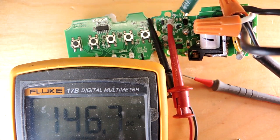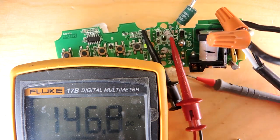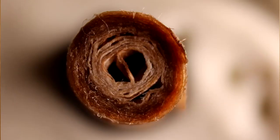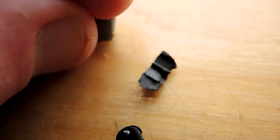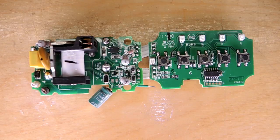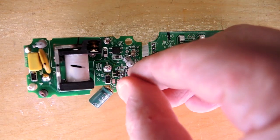It's a 22 kilohm resistor, so it's dropping a huge amount of voltage and dissipating about 0.9 watts. The problem is this resistor was placed right next to the capacitor. The design engineer essentially put a gigantic heat source right next to a capacitor, and that really shortens the life of electrolytics — it basically boiled off the electrolyte. I removed the metal case and unfolded the wrappings — the paper in the middle is absolutely dry, so indeed the electrolyte has boiled out.